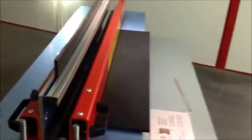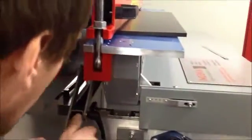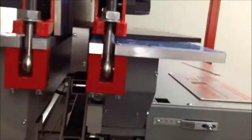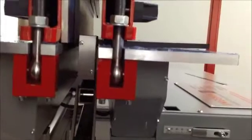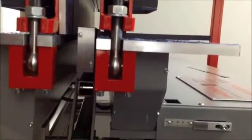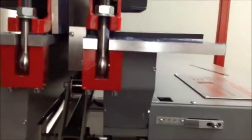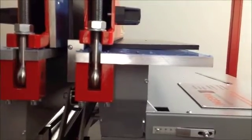Now we are going to open the table again. It's very important that the heater is put up in the right position — make sure the heater only comes about one millimeter above the vertical plate, so that you are not doing too much heating on the horizontal plate.